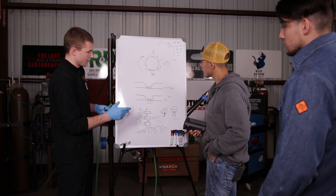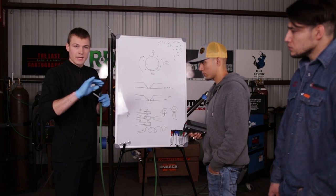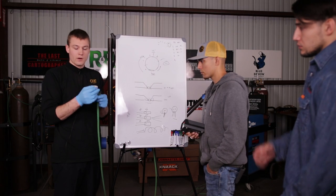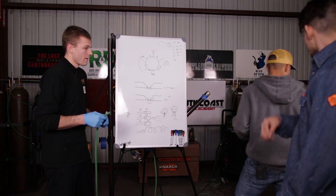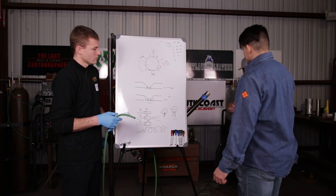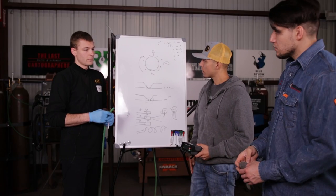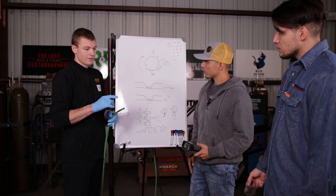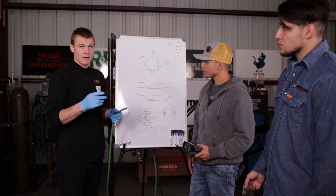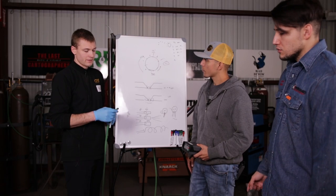It also helps if you take stainless steel wool — you could put it in the end of the hose or have it taped on the end. Without steel wool, the argon just shoots straight out. Steel wool is available anywhere, most commonly carbon steel, but you can get stainless steel wool so it doesn't contaminate higher alloys like stainless, duplex, or nickel alloys.